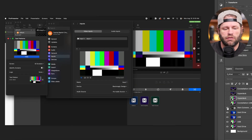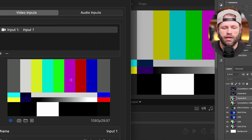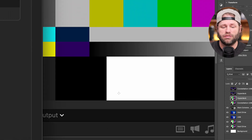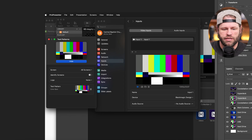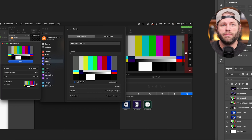Here you can see when I brought the Blackmagic device into ProPresenter and streamed the test pattern output to the Blackmagic device, bringing it back in at 1080p 29.97 — it similarly loses all of that information. The gray square is pretty much gone; it's faintly there but not much. That's your results from the ATEM Extreme, and I've noticed the same thing on my other ATEM Mini models. It's been reported before, but I wanted to actually test and confirm it.